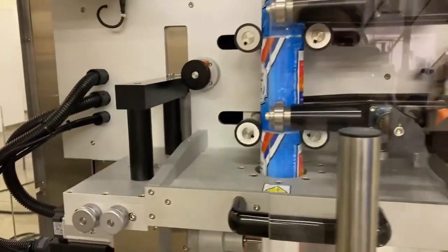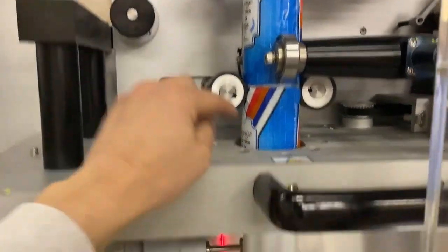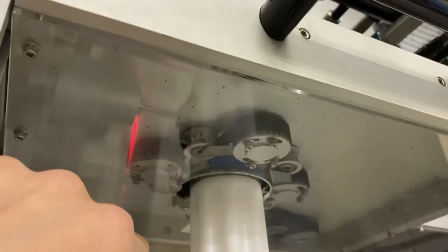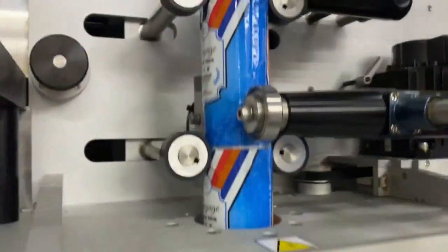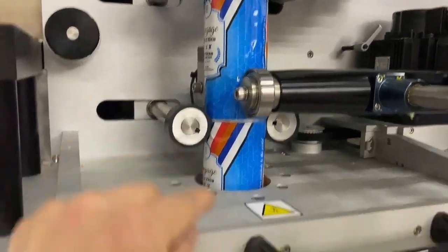This time allows for the film to travel down the mandrel. In that feed time, wait for the cutter to activate the blades to cut the film. Sometimes at higher speeds you need that pause so the film can stop moving before the cutter starts its cut sequence.